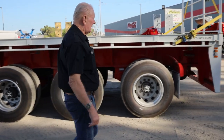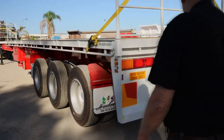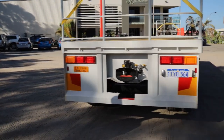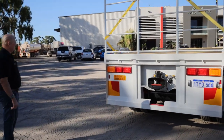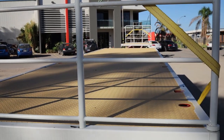All of our trailers over here are road train units. So road train unit, 50mm ring feeder, air and brake fittings, EBS braking as mentioned earlier. Load gates front and rear. The floor is 5mm checker plate — these are quite robust trailers. The combing is 120mm and the cross members are 100mm by 65 cross members with plenty of steel in there.